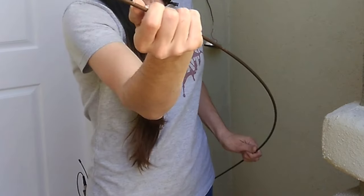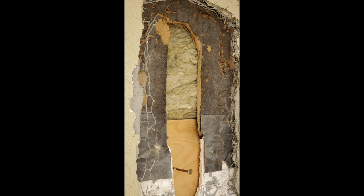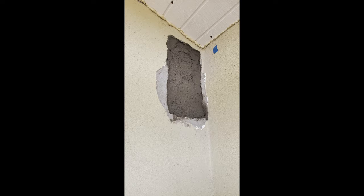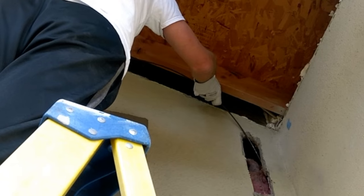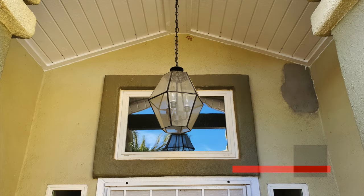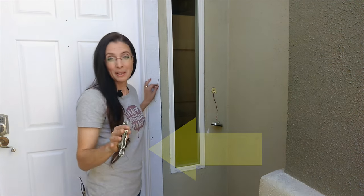Something to consider: a flexible drill bit is not always the best answer. When looking at your problem, ask yourself — is there an easier way to drop the line without the additional hassle of buying and figuring out the drill bit? Is it easier to make another hole right at the fire block, whether that's outside or inside? Consider all your options to make sure you choose the best possible solution.